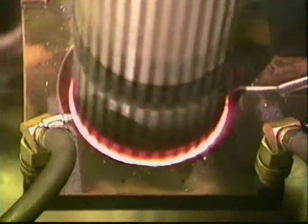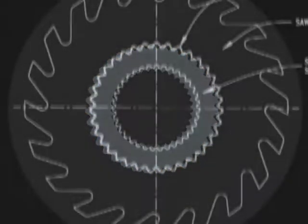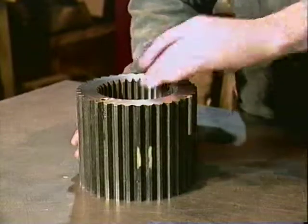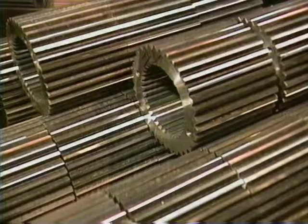When a sleeve is heat-treated, it does not distort the roundness and balance of the sleeve, because the splined teeth are equally distributed around the bore, and the residual heat-treat stress is not concentrated in one spot, like it would be with a keyed sleeve. The new sleeves are mounted on the universal splined mandrel and are manufactured to a sliding fit for easy assembly and removal. The hardened universal sleeves are interchangeable, reversible, or replaceable without the need for rebalancing of the mandrel. Vancouver Gear employs skilled machinists using gear cutting machines to manufacture accurate, naturally balanced sleeves to exacting specifications.